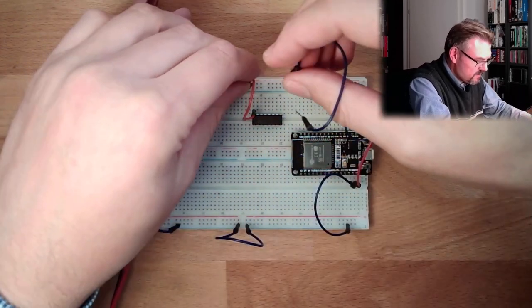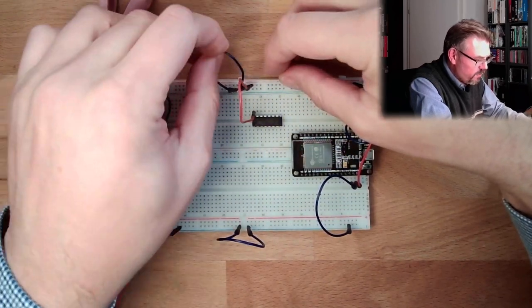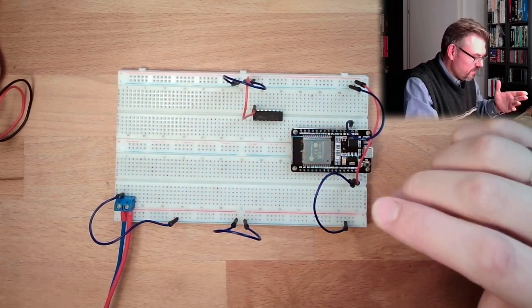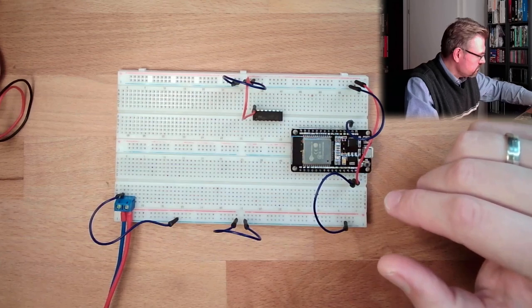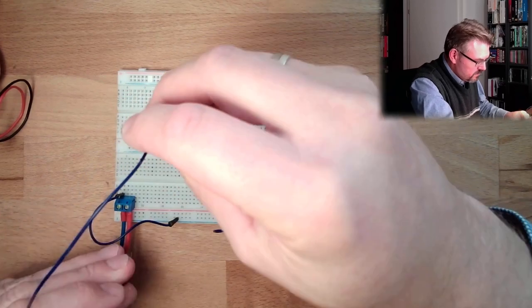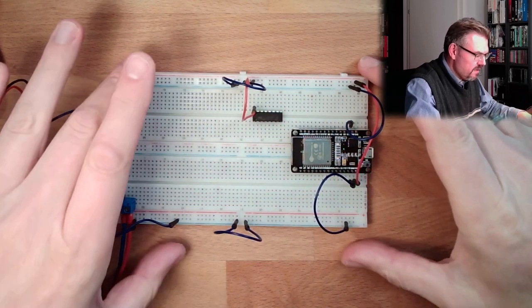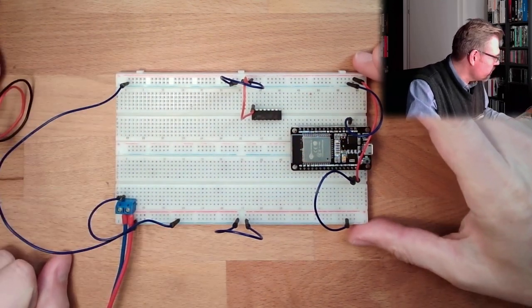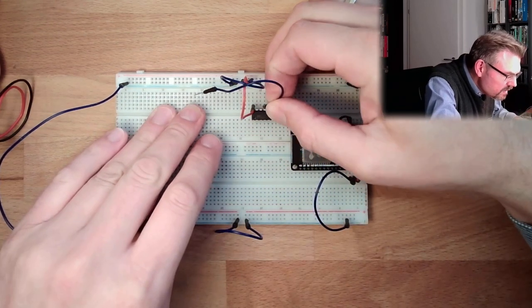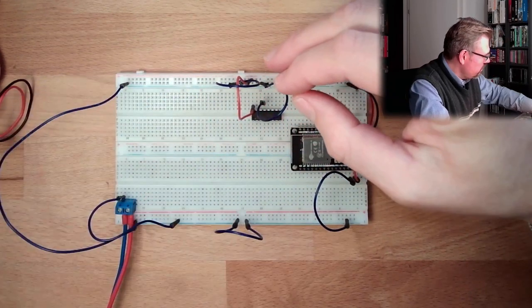This is a special breadboard, you know, where the grounds are not connected to each other. So I always ran into issues when I'm using this and wonder why there is nothing here. But then here's a break. All right, these two sides I'm going to connect. So we have a nice common ground. And now we are connecting the grounds here as well. So these two are ground. These two are ground.